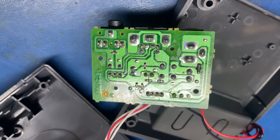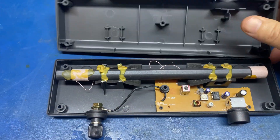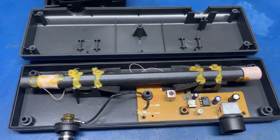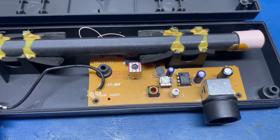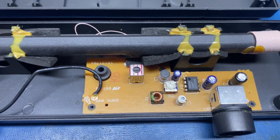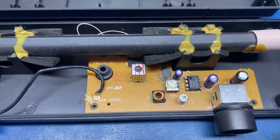Well, that's the biggest clue. Looking inside the head, we see the ferrite bar antenna with twin coils — one, two. But this board also seemingly doesn't have any preamp on it.